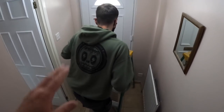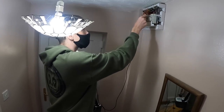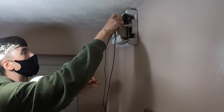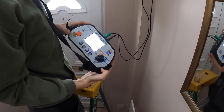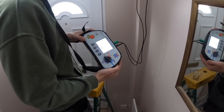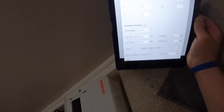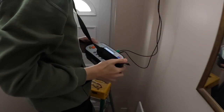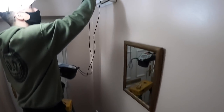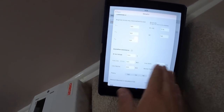Do it at 250 first — it's like a fail safe in case there is something in it like there was just then. Live and neutral — he's going to press test on the tester. Now we should get clear. So he's reading it — run that up to 500 now. Great, so now we can put insulation resistance greater than 500 megaohms. Now live and earth — 500 — greater than. And now neutral and earth — greater than 500. So that circuit's perfectly electrically sound.